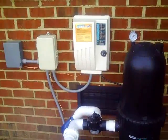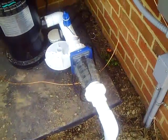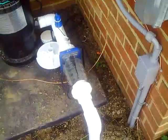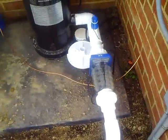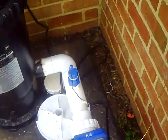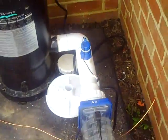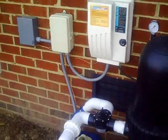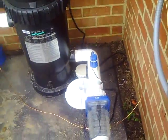The reason is so that the chlorinator cannot operate when the pump is off. As our chlorinator cell here — water passes through there, and the salt dissolved in the water is converted to pure chlorine gas. If there's no water moving and there's gas being produced, then that equals a potential hazard. Just up line from the cell, this little device here is called a flow switch — that's also to detect flow of water, so that the cell only produces chlorine when there's water moving. But this additional safety feature of having the chlorinator and the pump wired on the same circuit is a secondary precaution in case our flow switch were to fail.